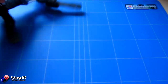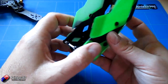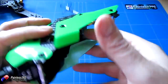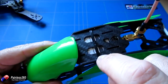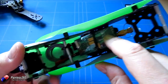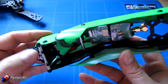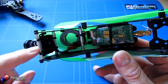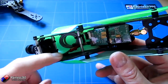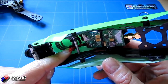The FPV equipment is straightforward — there's really only one connector from the base, which is the JST power lead that powers everything. You just need to install it in the top. I've installed my Fat Shark video transmitter at the top. Using a needle file I just lightly took out two little dents either side of the mounting plate so I could get a cable tie around it to keep it in place. The cable for the camera is curled up inside the dome, and the only other thing is the power lead into the transmitter via a little JST connector from the power distribution board.